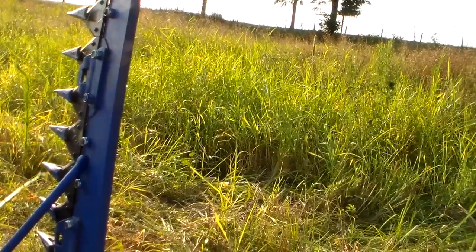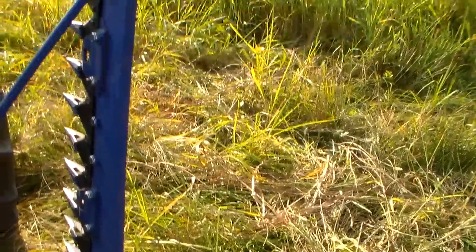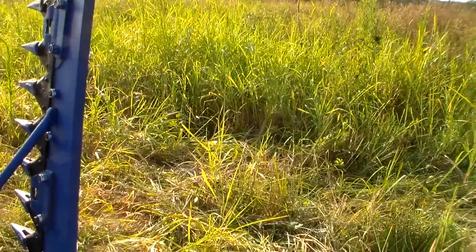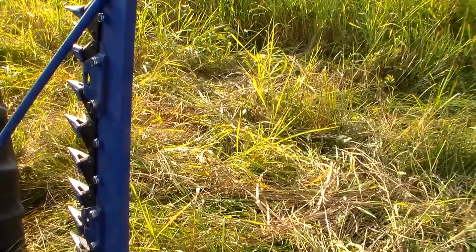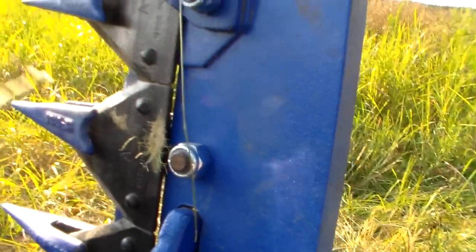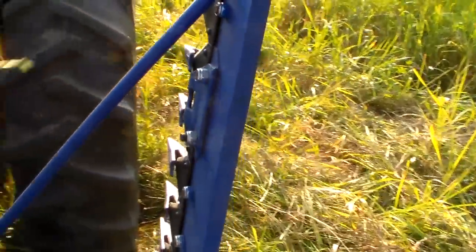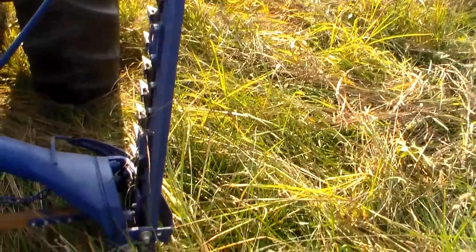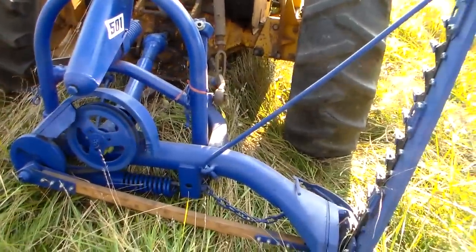On the guards, they're matched up. There are several different types of Ford guards — they have six-digit numbers. You've got the 800s, and you have to get the numbers together that will run together. The 800 is not going to run right on this bar mixed with the others. It'll run, but it runs on the sickle section differently — you'll feel a little wave in it. They had several different numbers of Ford guards and it's best not to mix them up.